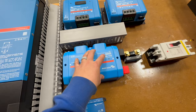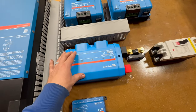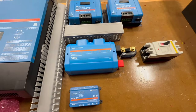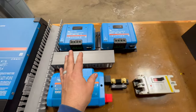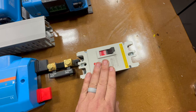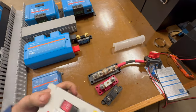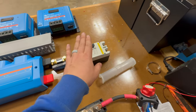Lynx distributor — this is really important. It's a nice bus bar system that keeps everything protected and the power managed very nicely. We always do them upside down — there's a label we flip around so we can read it, because we are a little OCD. We've got our SmartSolars 150 by 70s here, which will allow us a little headroom in case we try to get more panels. We've got the smart shunt — that's what we're using to measure our battery. And here is what we're doing for circuit protection and disconnect. These have really nice contacts and connections, and so far it seems to hold up to heat long term, actually doing 200 or maybe even 300 amps continuously without a problem.